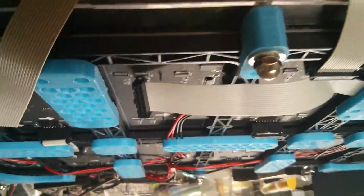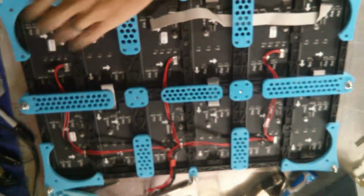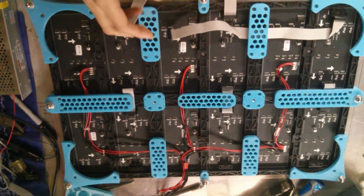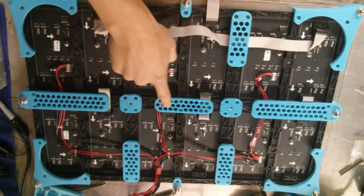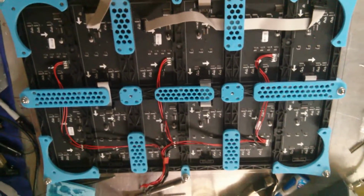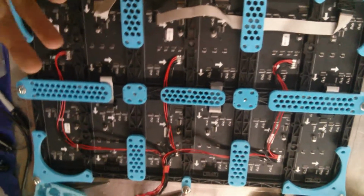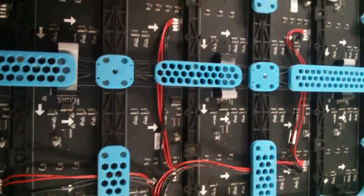After you get your parts modeled, at least this is how I did it, in my Blender file I have all of these brackets laid out just like this, with the panel being there. I can then do Boolean differences on each individual piece, or in some cases the arrays of pieces, and it will take the panel out for you automatically. And you can change things around later, and you don't have to worry about changing the geometry that you earlier committed to because you had to subtract for the panel, which is usually my first step.